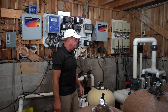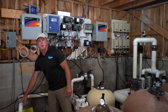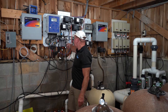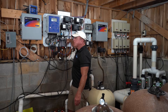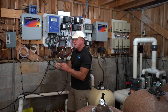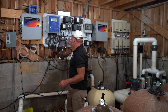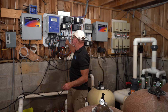A few of the basics here: you have to have water feeding in from your pump, which would come into the input here. You have shut-off valves, and the importance of having these shut-off valves is because there is a filter here that you are going to have to unscrew and clean — a little screen in here. You pull that out, rinse it out with water, make sure everything is clear, and then put it back on. That's to prevent debris from getting into the flow cell.